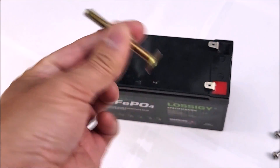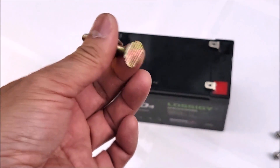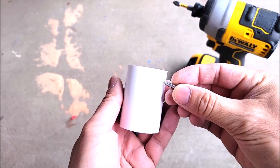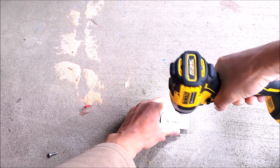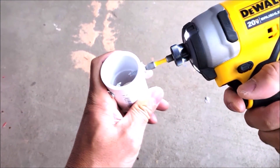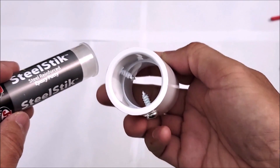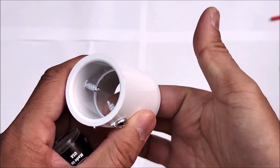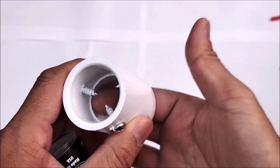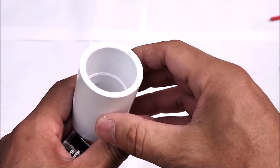I have a quarter-inch 20-thread bolt and nut with a flat head — that's going to fit the track mount. These are sometimes called toilet bolts or closet bolts. The next thing I'm going to do is screw that bolt into the PVC coupler, then mix the epoxy and stuff it into the coupler. The coupler has a ring in the middle — make sure the epoxy doesn't go past that ring, because your pole is going to be inserted from the top and you don't want anything to obstruct it.